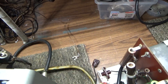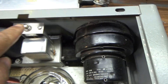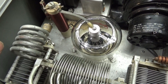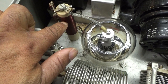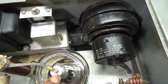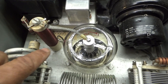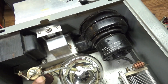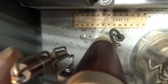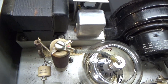Turning it back over: you've got your big blower, filament transformer for the single 3500Z, and a safety interlock that disengages power when the cover is off. You've got your tube, your chimney, your RF plate choke. What this does is allow the DC to come in through the bottom and up to the tube for high voltage, but the RF cannot go back down through the coil — it blocks the RF. These two resistors with the solid wire over them are your parasitic choke, which stops high-frequency oscillations.